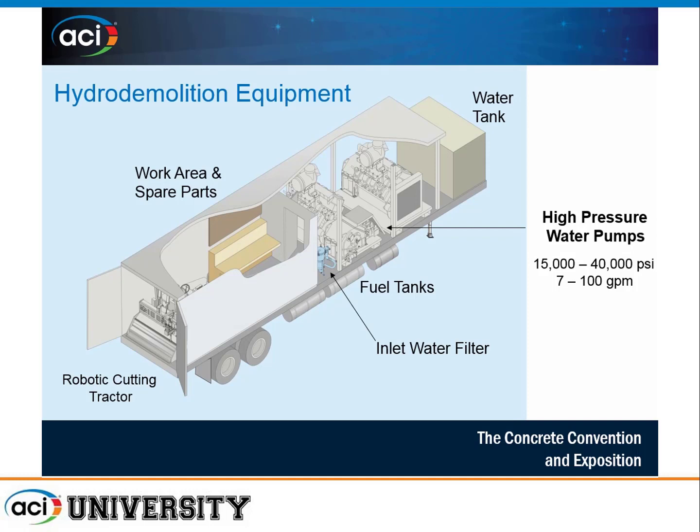What type of equipment rolls up to a job site? Following the story of the water: you'll have an inlet water filter, as most applications specify potable water sources, though a primary filter is important when that's not always the case. A small reserve tank ensures pumps don't cavitate if the main source is cut off. Water feeds into engine pump assemblies — high-pressure pumps in the range of 15,000 to 25,000 PSI, up to 40,000 PSI for ultra-high-pressure systems.